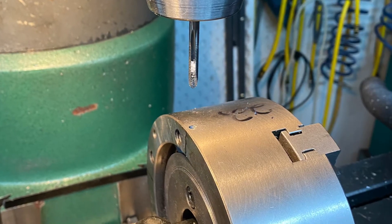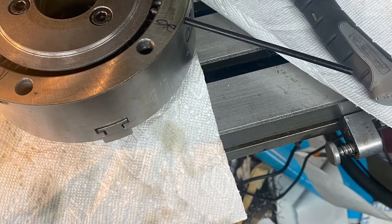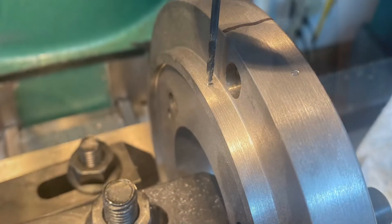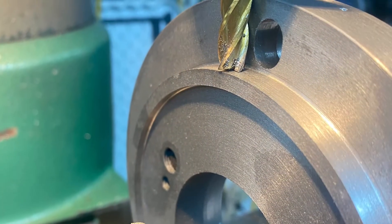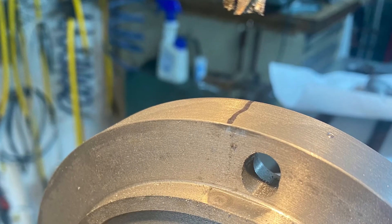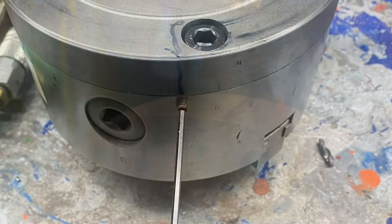They don't need to be much, because you're going to have the mounting bolts a little loose when you adjust them — they just need to move things around. I use a transfer punch to punch the backing plate there, and then I'm cutting little flats where those center punch marks are, so that as you adjust those little set screws it can slide the opposite direction on the backing plate without just riding on top of the round part.